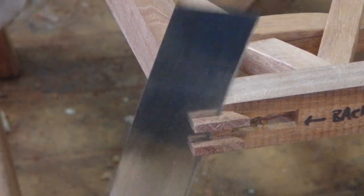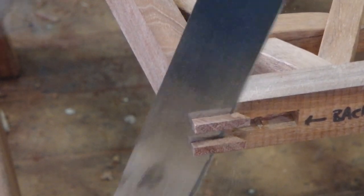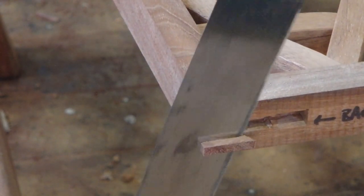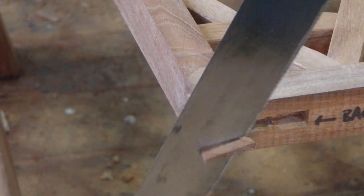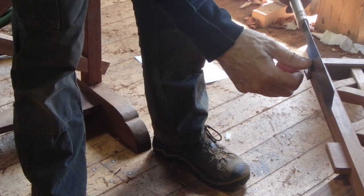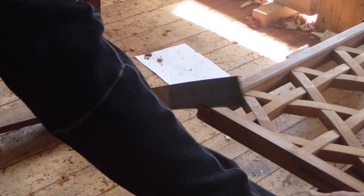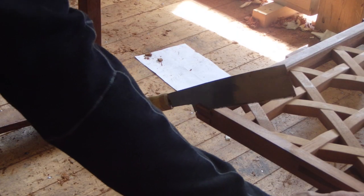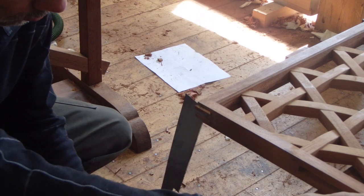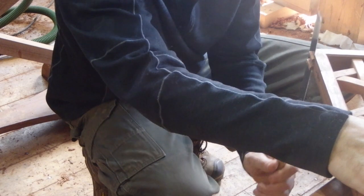This video does not begin at the beginning of construction, but rather we're joining in at the stage where I am completing some work on the latticed side panels of the cabinet, the corners of which are fastened with a pair of glued-in Bubinga splines. The material for this cabinet is a combination of Cuban mahogany, which is akin to working with unicorn horns these days. And I had some exceptionally wide planks of Honduran mahogany, 48 inches wide, which allowed me to obtain quite wide quarter sawn panels for the back, top, and doors of the cabinet.